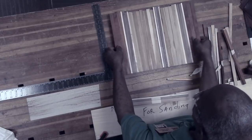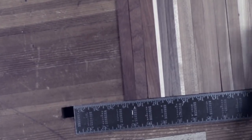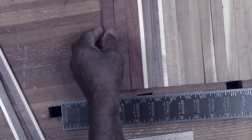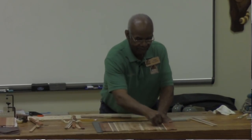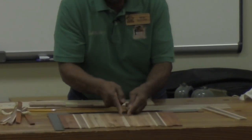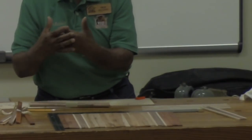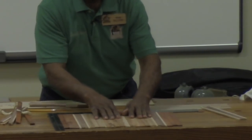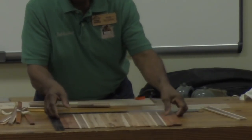Once I do that, I normally clamp this to my work table. When I'm putting my mat together, I have slats, and everything here is square - it's going to fit square into my trimmer that I made. So as I lay my pattern down, this end from bump to bump is square. This end doesn't matter - I'm going to trim it all off anyway. What I want to be able to do is mix and match the woods. I don't want one mat to have a lot of sapwood in it. When I'm making a set of four or six, I'll lay them all out on the table and mix and match the wood so I get the same variations of colors in all four mats.